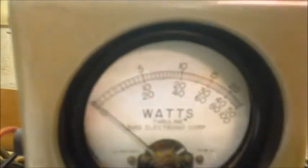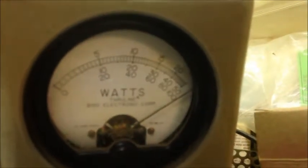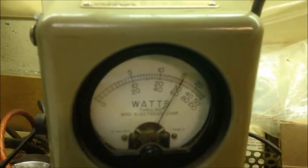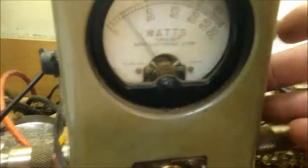Now let's get on with the watts. 50-watt slug — a little over 2 watts dead key. On the peak side, it's about 13. This cord is giving me trouble, gotta get another mic on here. Hello, 50 in the corner — switching up to the 100-watt slug. Switch out — not bad at all.